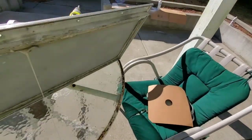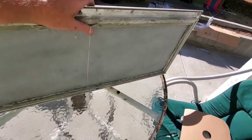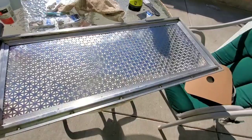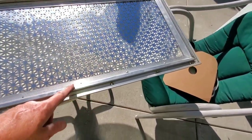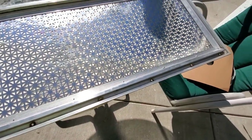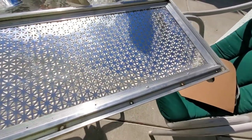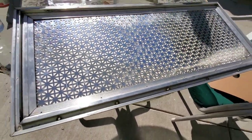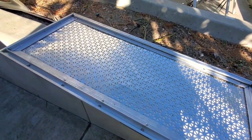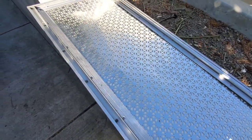The back has been double sealed with the butyl tape — you can see a little of it coming out there, and that's okay. That's going to be mounted into the rig. The inner door is never going to open. This is strictly for show. So I'm finishing this off with number six by three-quarter stainless pan head screws, and I think that gives a really nice finish detail. I'm going to go all the way around the frame. That'll give additional holding power to prevent water intrusion. The frame is all ready, it's all screwed tight, it's all watertight.